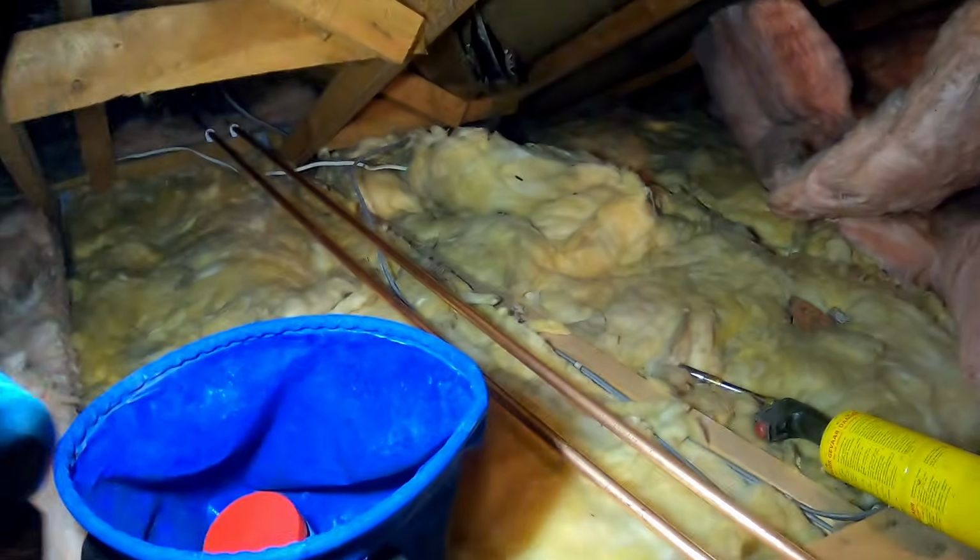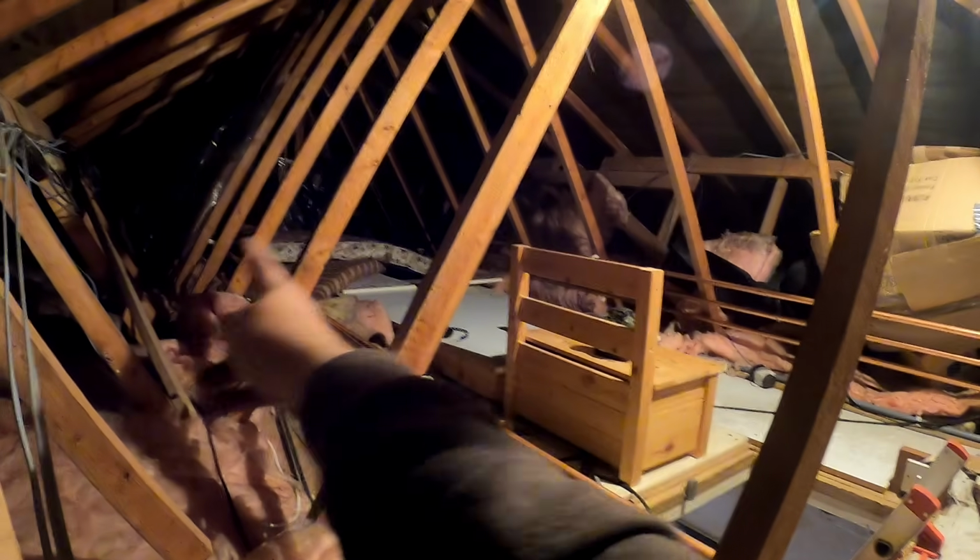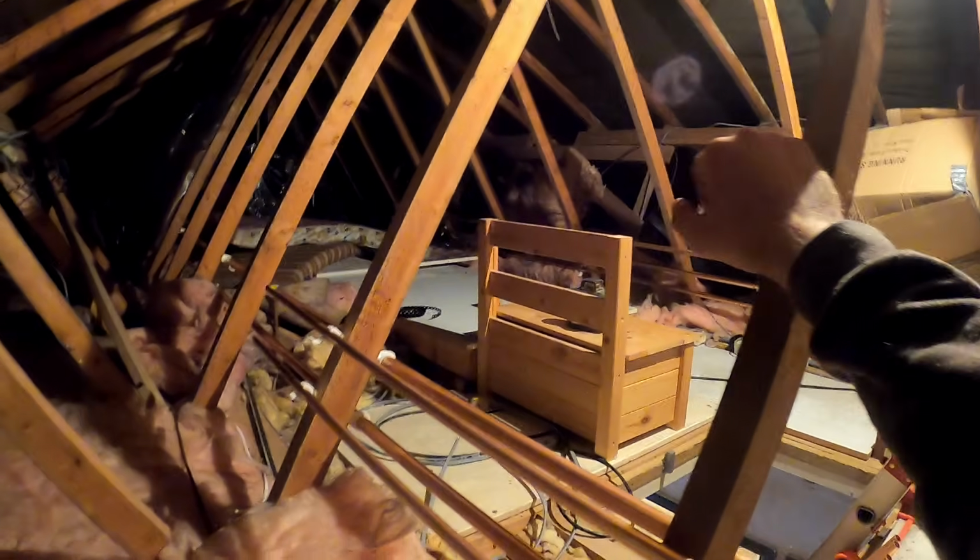It looks straight enough to me. I think we're going to have some more tees here somewhere when he gets chased in. I think that bathroom one's down there, but I'm going to get these joined in to our main flow and returns coming across this side. You can see why I've done it on 2 separate runs now, because we're not crossing anything across. But basically this side's going to pick that side up and that side's going to pick that side up.